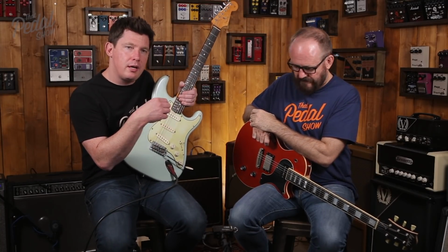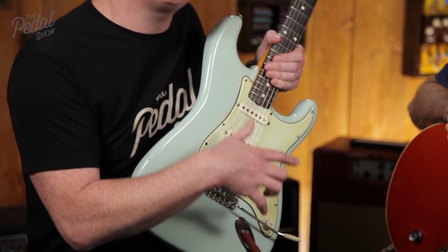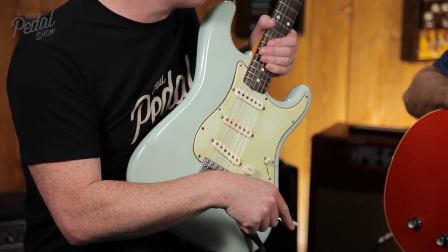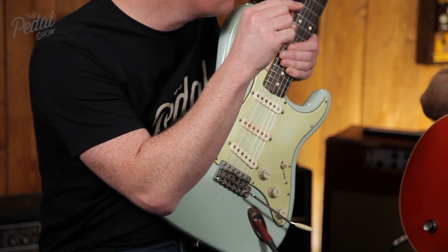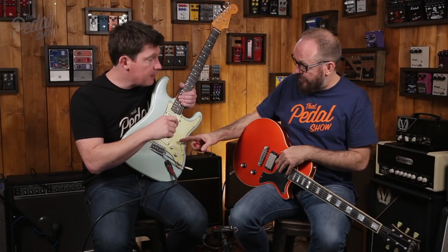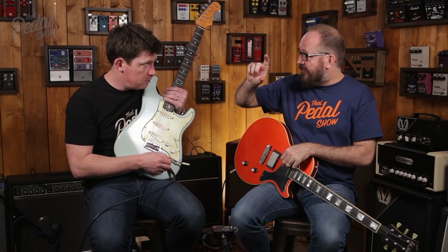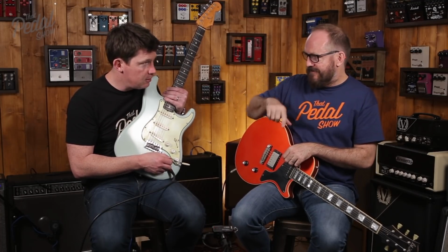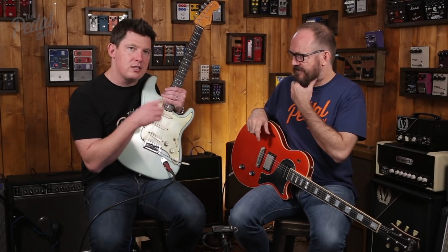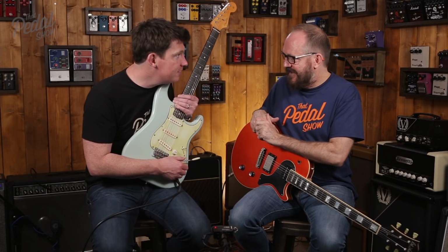What happens with a potentiometer? It's a variable resistor, right? So when you turn it down, more treble gets bled to ground. Or high frequencies go to ground, don't they? When you turn it down. So the standard thing, you're just letting more of the signal go to ground, but those high frequencies are the things that are first affected. So when you put the treble bleed mod on, it stops that from happening. That's right. So it should be called a no treble bleed, right?